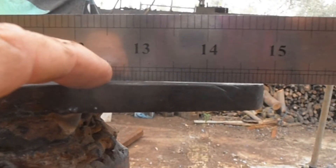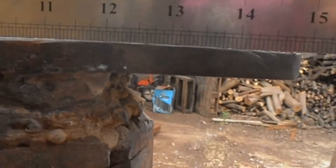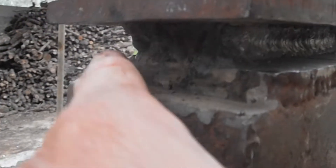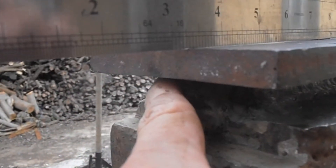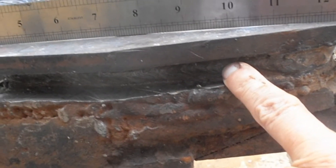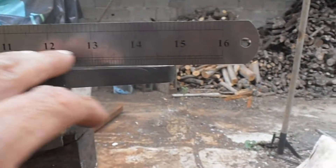I'm going to apply some heat on the top part to hopefully make the tail go up one millimeter or so. Then I'm going to clean the edge of the welding and start laying some beads simultaneously along the length, which will hopefully get the top plate slightly more straight.